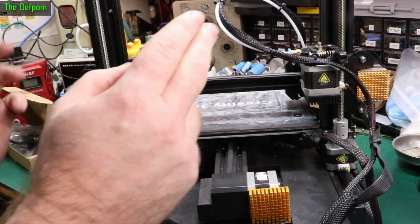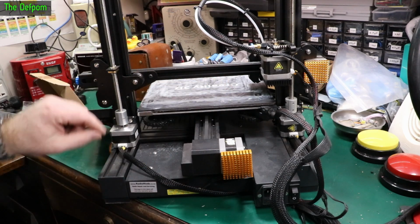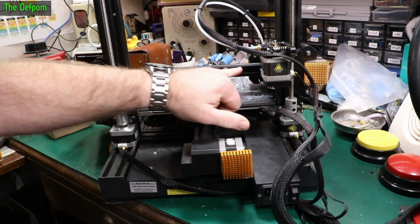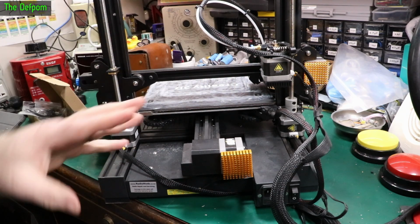Now the only tricky thing, when you've got two stepper motors in parallel, is that they could potentially fight each other a little bit. I haven't had any problems with it. And obviously one thing you'll need to do is, because you could potentially turn one and not the other one, you can see that one's turning a little bit, but you can see the gantry twisting a little bit there. So when you're setting this up initially, you need to make sure that these heights, each side, match. I'll cover that in the previous video.